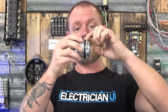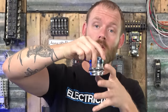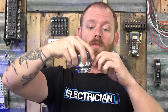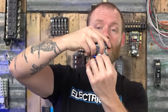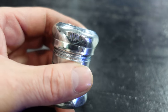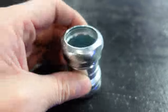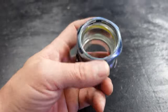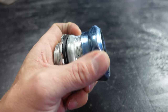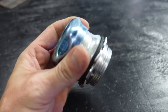The other thing is you can tell that there's this little bushing, and this bushes against moisture coming into the enclosure once the conduit and the fitting are attached and tightened — so there's one barrier for moisture to enter through. Inside, a normal compression coupling only has a metal ring that tightens to the conduit, whereas these have a metal ring but also have a little plastic bit inside that is an additional moisture barrier, allowing for more added protection against moisture entering through the outside of this fitting.